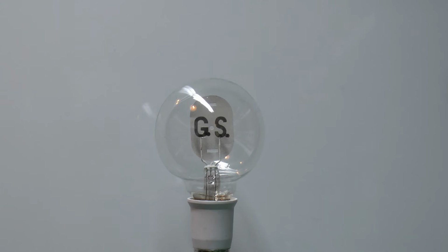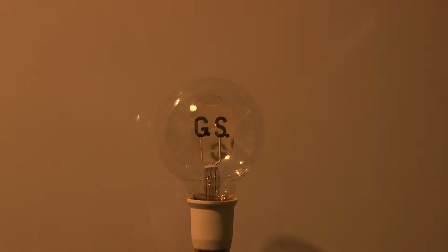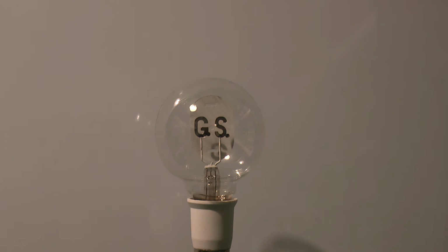Now here's the lamp. I've just set it out against a white background there so I can see it a bit more clearly. Now obviously the lights are very bright here, so it'd be advisable to turn those off, so let's get rid of those. Just use the other lighting. And I put this on a variac because I don't want to just bang the full 250 volts mains in there, as the voltage in this building is on the high side anyway, and although this thing is rated for that, then obviously it might not be an idea to just shove it straight through, particularly given the age, and things are quite delicate. So now the camera's actually fixed up the white balance there properly, we'll just crank up the voltage and see if we can get any kind of response.